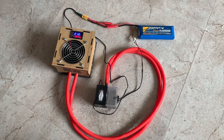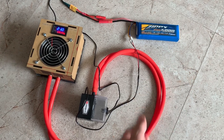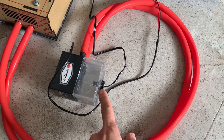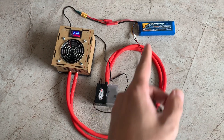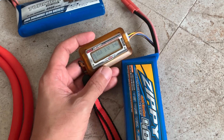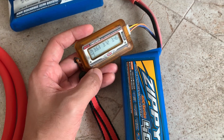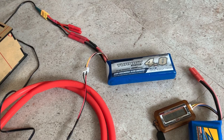As I plan to make this system portable, I'm running a battery test using a 4000 mAh 3S lipo pack. I've also replaced the thermometer that came with the water chiller with one built into the cap, which is really neat. After 35 minutes of run time, the battery gets pretty warm, so I disconnected it and measured its voltage. Each cell is still more than 3.3 volts, so it's drained to about 9%. With two of these batteries hooked up, I should get one hour of run time.